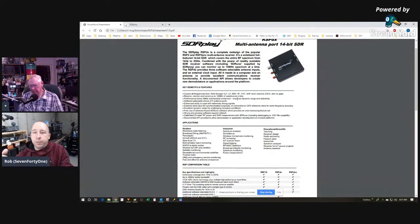One of the main features of this too, along with the improved performance below 2 megahertz, is this new high dynamic range mode that's available below 2 megahertz, which increases performance down there. It's not going to change signal strengths or anything like that, but it's going to improve IMD and things like that, I believe. I haven't fully tested or vetted it yet, but just from casual use over the last couple of days, it's definitely working.